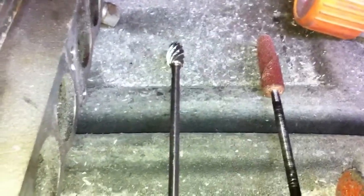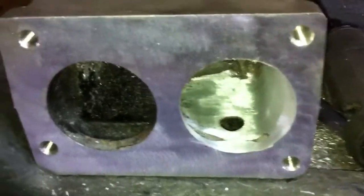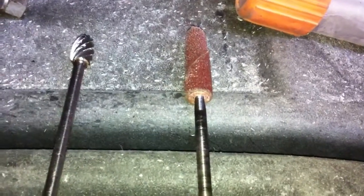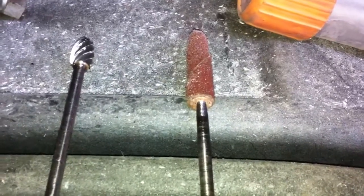What I start out with are the standard tools: this die grinder with the long open flute carbide for non-ferrous metals like aluminum — that's how I do all the shaping and get the size and shape I want. Then I finish with this die grinder that has an 80 grade cartridge roll — a standard abrasives cartridge roll, two inches long, half inch in diameter, with a quarter inch hole for the mandrel.